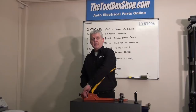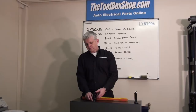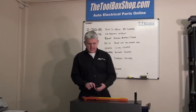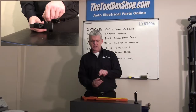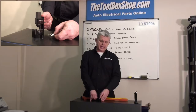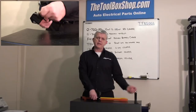In effect, you're holding the terminal and you're holding the cable — the only thing you've got left is your armpit. I'll show you this in a minute. This particular one is the Durite 0-703-90, and it's for terminals up to 95mm. The principle behind it is: we place the terminal into the crimper, it's spring-loaded, so the actual terminal is held tightly in place. That allows us to hold the cable in and then strike with a hammer. Notice I've got two hands — very ideal. Instead of holding the terminal and the cable, I'm holding the cable and striking with a hammer.